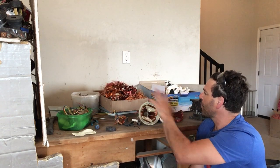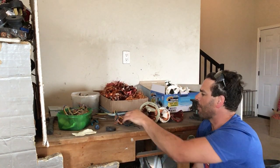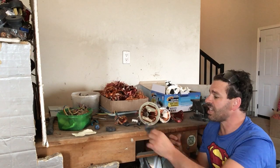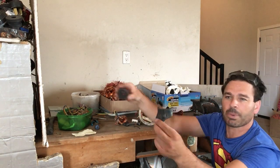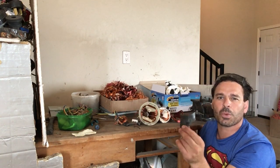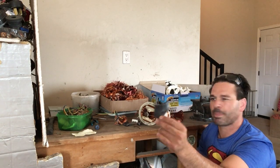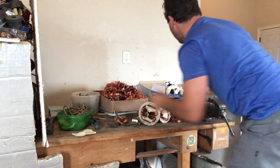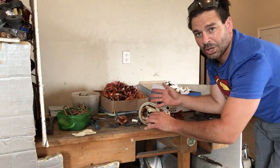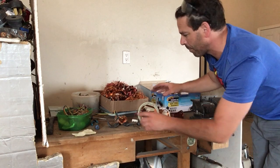I have a number of different sizes that came out of different size TVs as well as computer monitors. I'm going to save a couple, break them open for you, and show you how easy it is. These yokes will have a type of magnetic material called ferrite that goes around them — this will be going into my tin or shred pile and I'll still get 8 cents a pound for it. I also have a box here of some of the plastic waste. I'm going to weigh it all at the end and show you how much copper, how much ferrite, how much waste, and how much profit I made from these yokes.